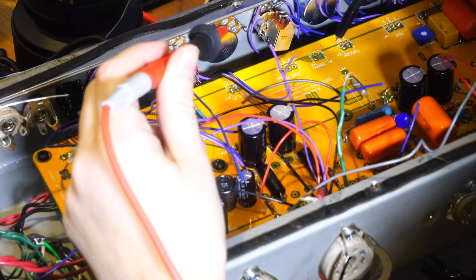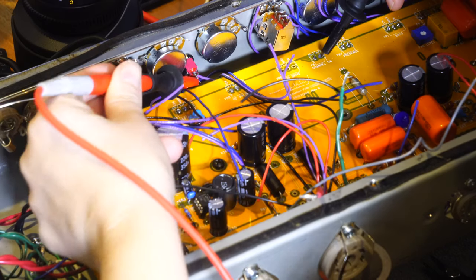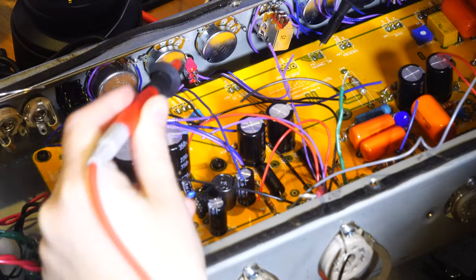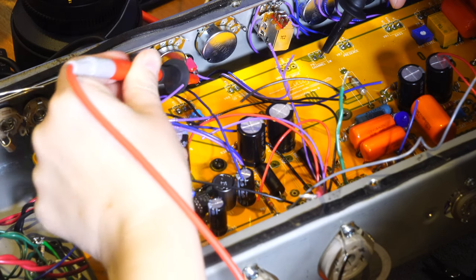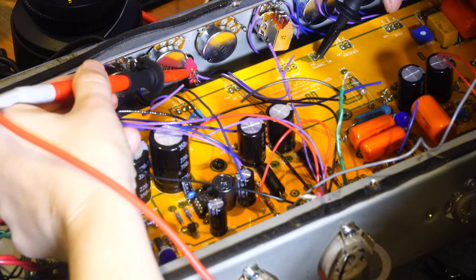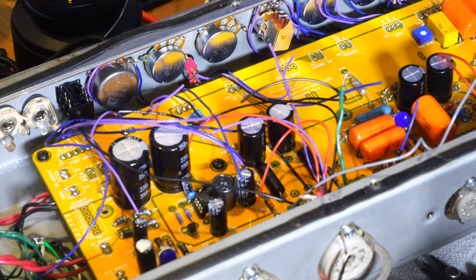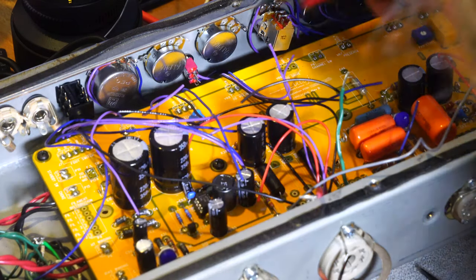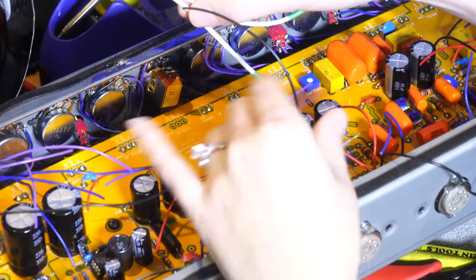All right, which one was this one, the channel? Channel switch, yep. And the switch is engaged. Now if I turn the switch off, you should try it again. You won't get continuity on both, only on one. I hope that's the case. That's the case. Right. Yeah, the switch jumpers them together and they become one wire basically. But if the switch is open, then you wouldn't get it. Another solder complete. Cha-ching.